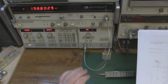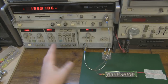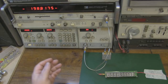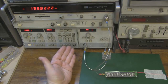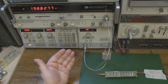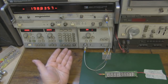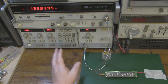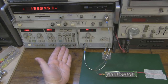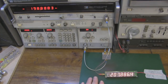You'll probably see on my frequency counter it's just a little bit lower than the output frequency on the signal generator, and that's because I'm using the signal generator on CW mode — it really needs a good 45 minutes to warm up to get to a precise frequency output. Normally that doesn't matter when I'm using it for testing antennas and things, but in 45 minutes it will be bang on. The sweep generator hasn't been calibrated in two years; this was calibrated about three months after I got it, and I've probably had it just over a year now.